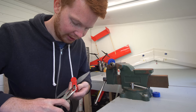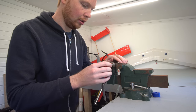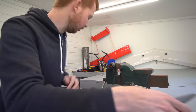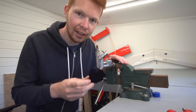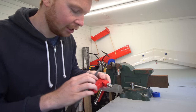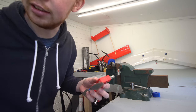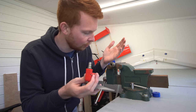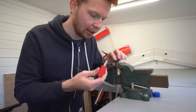So it's leaking out of quite a few places. I'm not sure exactly what to do about that. I actually think it's leaking out of the connector. It turns out the engine is not the leak — it is leaking slightly out of the top of the cylinder here, but that's probably the gasket needing tightening, so I'll tighten up the cylinder head a little bit. This connector is for some reason leaking — sounds like it's internal in the connector.